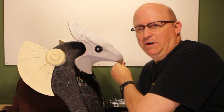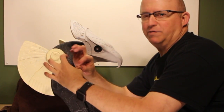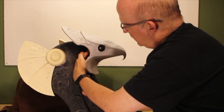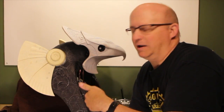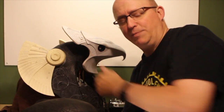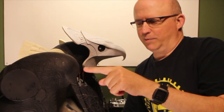This one gets a red lens that covers it when I send it back to my friend to get painted. On the original movie helmets — I didn't have access to one, they're kind of expensive and rare — I believe the mechanism to enable the head to move up and down and left and right was similar to an animatronic eye mechanism: a gimbal with two rotating collars, one moving inside the other, for up-and-down and left-and-right. On those movie helmets they had a flat aluminum plate with a rod that mounts inside the head. I wanted to keep the original casting piece and put two servos inside there, making it pivot almost right at that point.